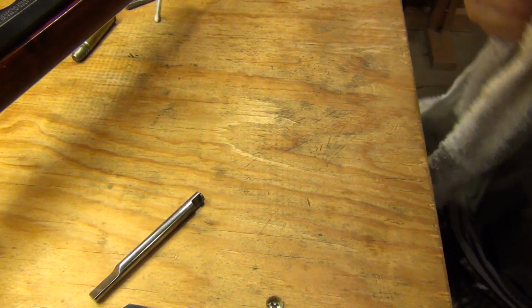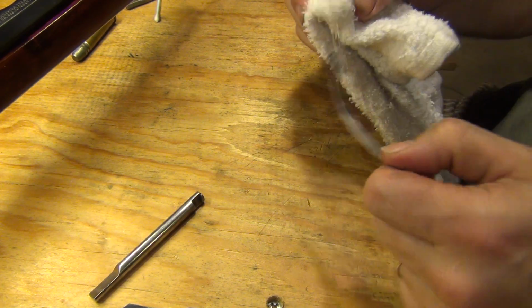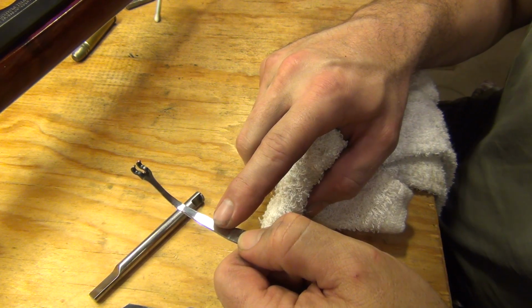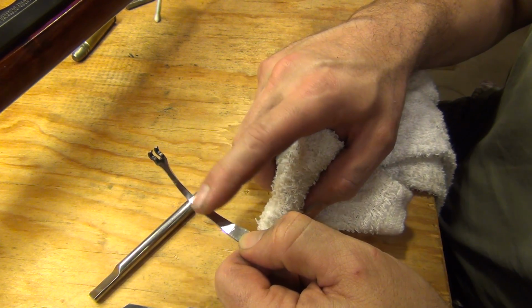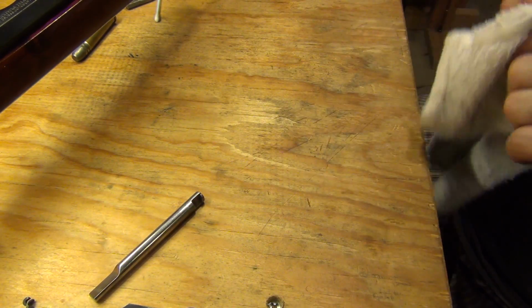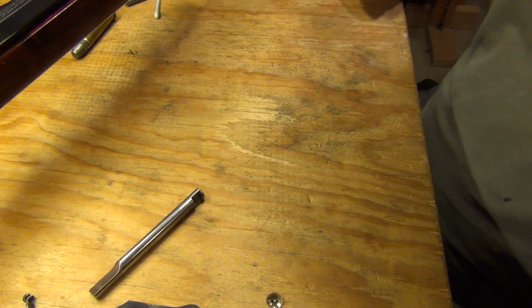And this is the spring I finished grinding on. Well, filing on and polishing. It's nice if you can put a good mirror polish on a spring. That's why springs crack typically, because they've got a scrape or a line somewhere that creates a stress riser. And that's why springs tend to crack.